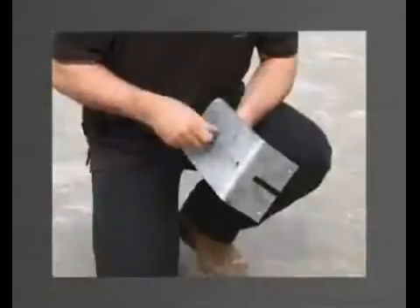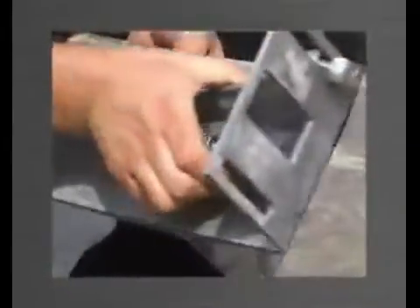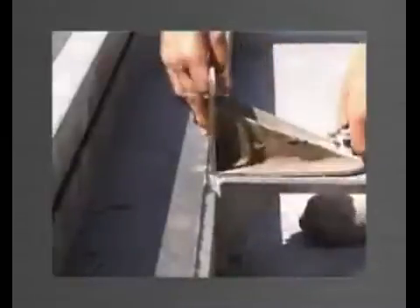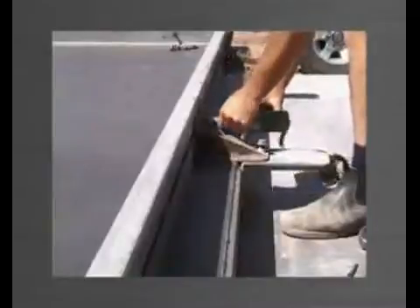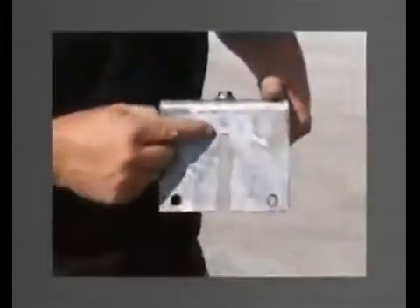In the event of a panel reducing in size by up to 300mm from the panel below, the purlin bolt can be transferred to the front nut, allowing the top bracket to slide further inward, reducing the size of the panel. A flanged head purlin bolt also anchors the bottom bracket into the ferrule in the panel below, through the vertical slot in the front of the bracket.